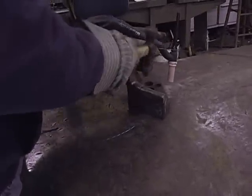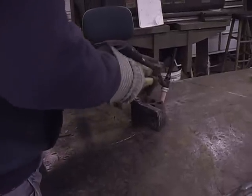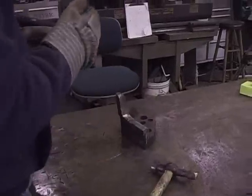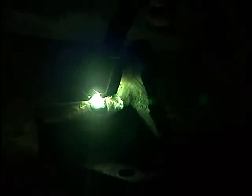This is a T9900TS tool steel. It has a Rockwell hardness of about 56 to 57. It takes high impacts and it'll hold the edge for you. He'll put another bead on there and build up that edge. He can put on one or two passes, whatever he needs after the T4400CG. He can then put on the T9900TS.